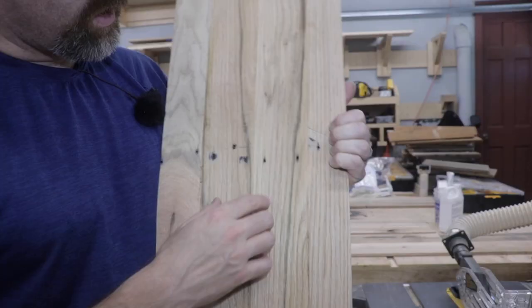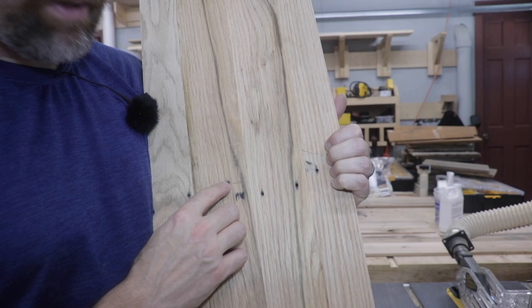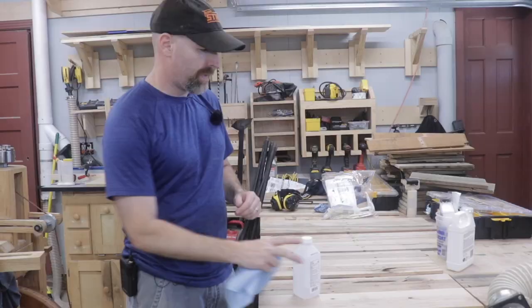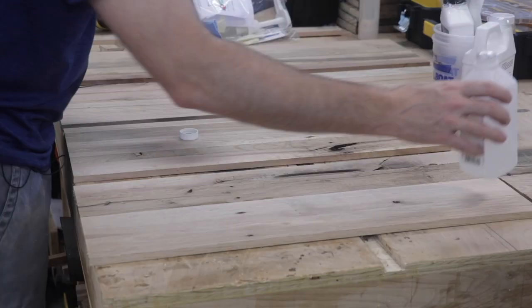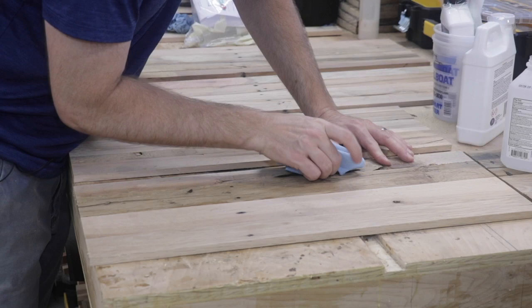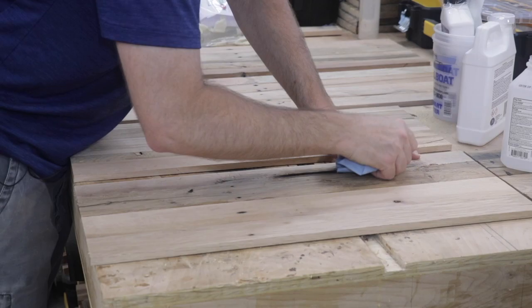A lot of the beauty in this material is the nail holes that are in the pallets, and I'm going to leave those alone unless one of them is going to compromise the strength of the panel — I really like the look of those and I don't want to hide them with the epoxy. So the next thing I'm going to do is clean out those defects with a little bit of rubbing alcohol to get the dust out and let it dry really quickly. Today's video is in no way a tutorial because I have never done this before, so I guess if you haven't either, we're just going to learn together.